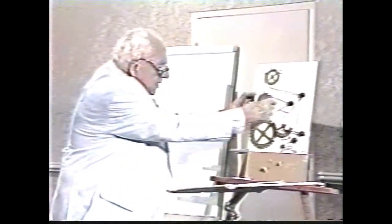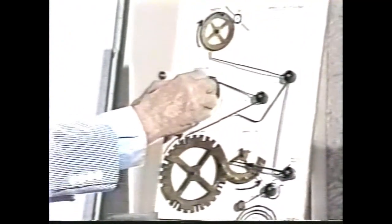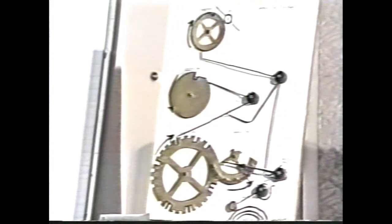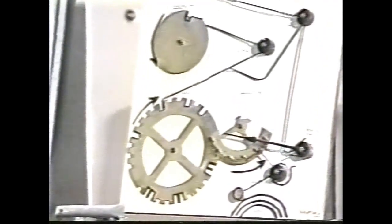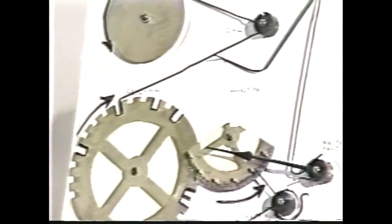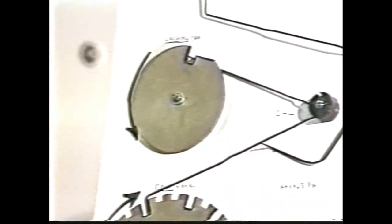The weak spot is right over here. When the count wheel hook, when the locking cam hook drops into the locking cam slot, it goes whack against the front edge of that locking cam. And it does that every hour, sometimes twice an hour, 24 times a day. After week, month, year, decade, generations, century, somewhere along the line, you can be sure that that whacking taking place against this front edge, you're going to get a little bump, a little dent at this spot over there. And if you get a little dent over there, and realizing that this is on the powertrain and being turned counterclockwise as you look at it, nothing under the sun is going to be able to unlock that train. That will happen in time.